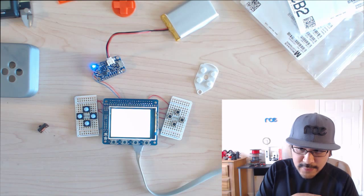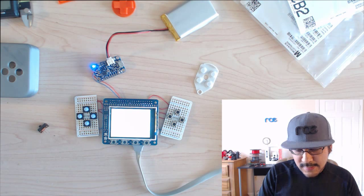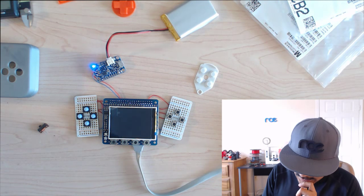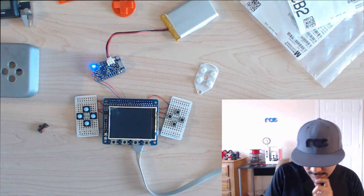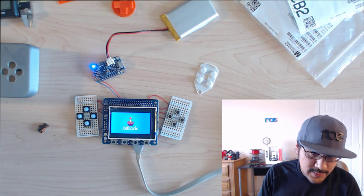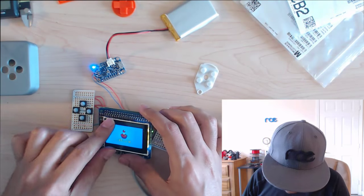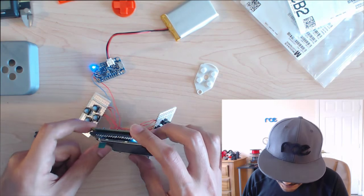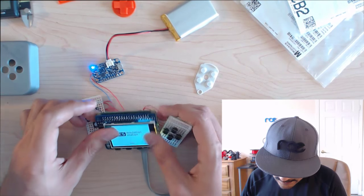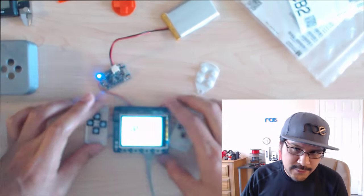What I did most of the time yesterday was installing RetroPie, getting RetroGame to map all the buttons to the GPIO, and figuring out what are some good GPIOs. Everything is working okay. The start time isn't too bad - it takes maybe 20, 30 seconds. Ideally I wanted to wire everything to these available pinouts here, but I kind of screwed things up so I ended up wiring things in the back. This isn't how it'll eventually be, but it still works this way.